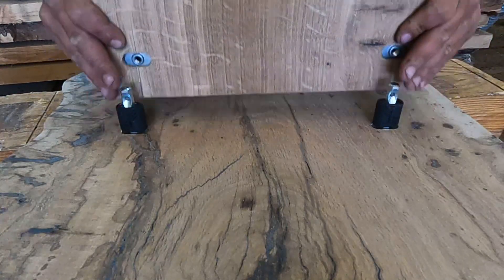Cutting out the two front legs with a slight taper. Cutting out a round accent in one of the legs just to make it visually more appealing. Cleaning up the jigsaw cut with the spindle sander to make it all nice and smooth and uniform and even.